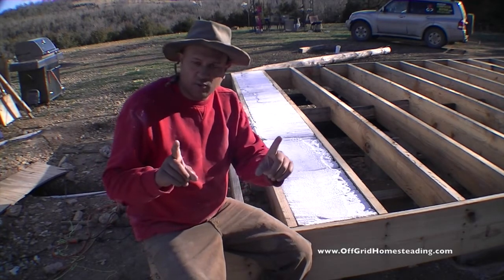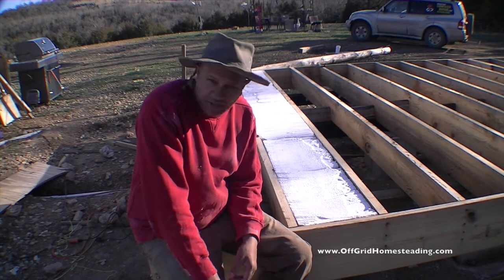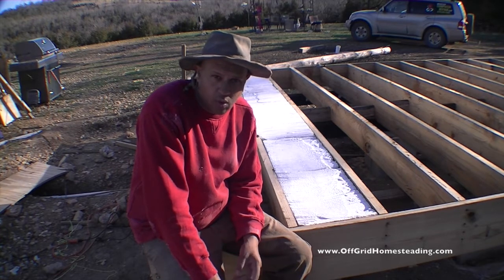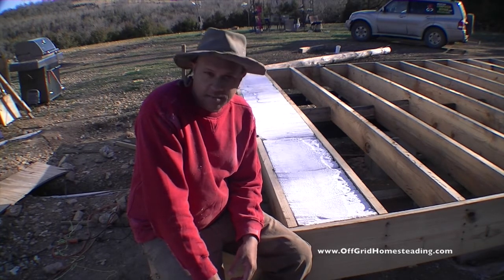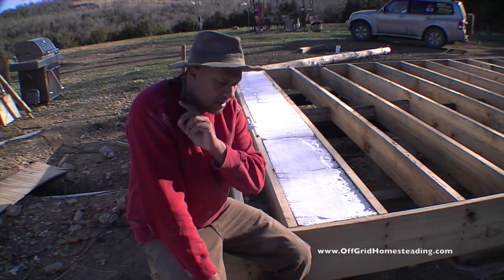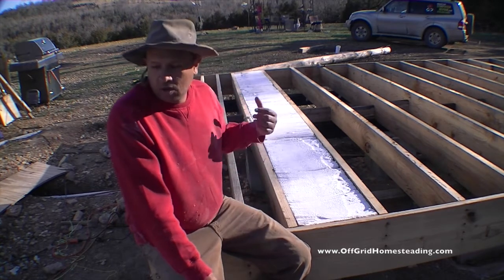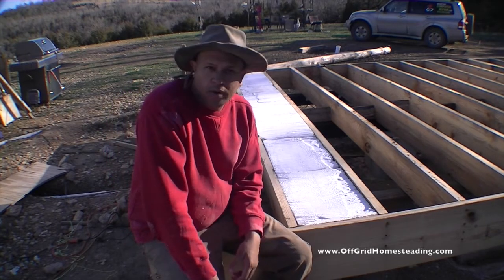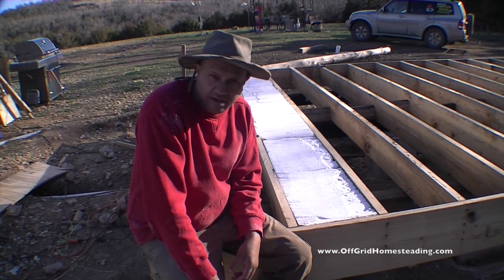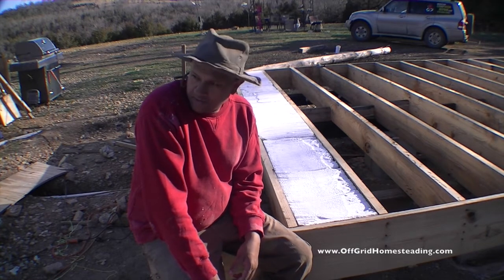When I went down to 14 and a half inches on the new cutter, that thing cuts pretty good, pretty fast, except for when it hits moisture inside the foam, and then it just kind of slows down to a crawl. But outside of that, it did much better than the big one. So the power supply, the 10 amp 30 volt, will go up to about 20 volts and about 8.5 amps on the big one. On the small one, it was doing about 13.5 volts times about 9 amps, 8.5 to 9.5 amps. And it was hauling right through the smaller wire and the smaller cut.